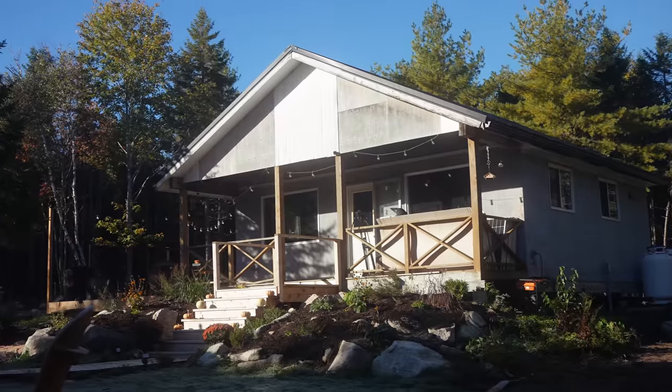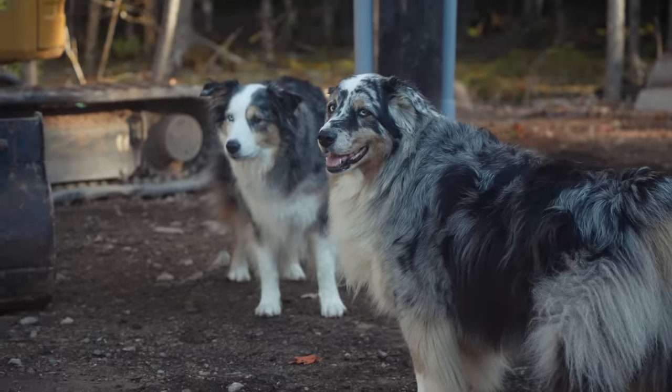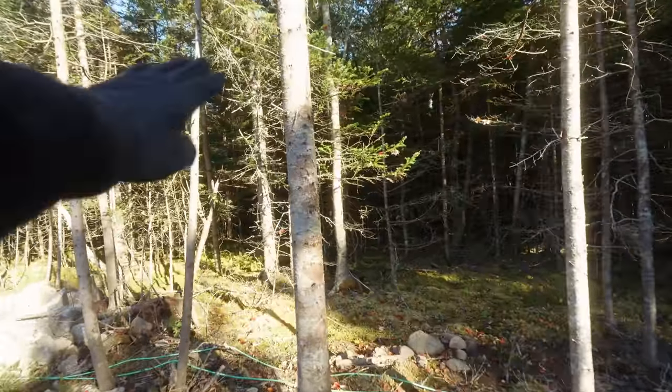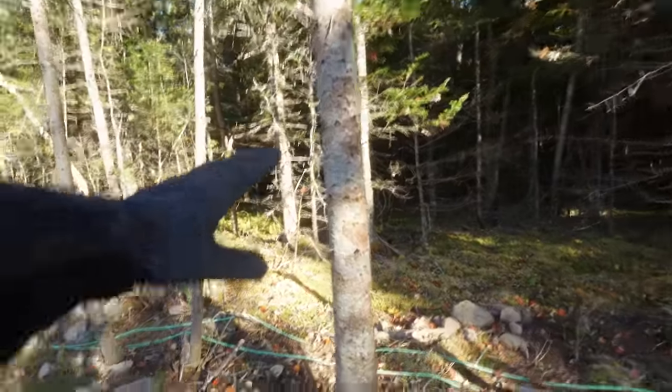So you might be wondering, it looks completely shaded here. And yes, you're right, it does, on the ground. However, we're going with the TPM 12, which is a single pole mount system, but we're doing that times two. The first panel is going to be 6 feet in the air, with the top one being over 11 feet tall. If you look at the trees, they have sun even 4 feet high.